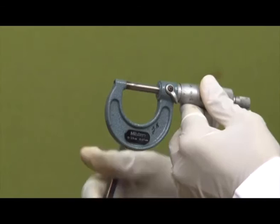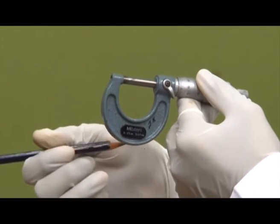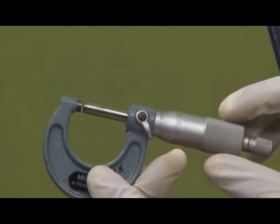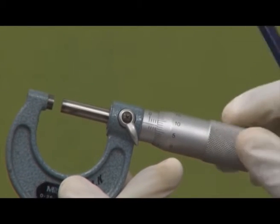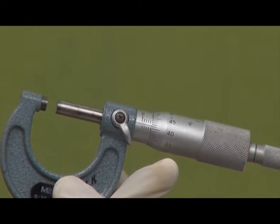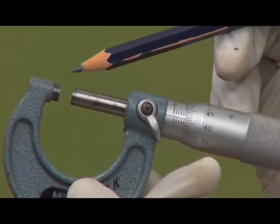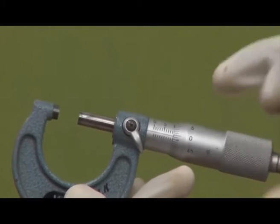The various components of the micrometer: the first is the anvil, which is the fixed portion. When I rotate the micrometer it opens — it is also known as a screw gauge, because it works on the principle of a nut and screw, just like loosening or tightening a screw. The anvil is the fixed component and its surface is very flat — the flatness is quite precise.